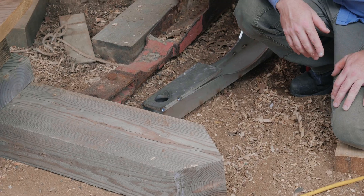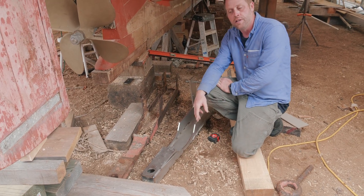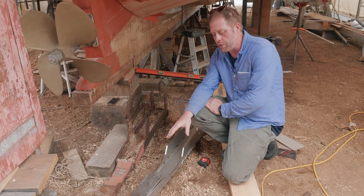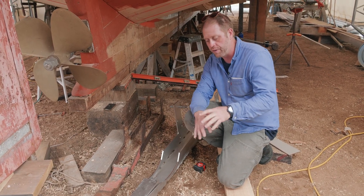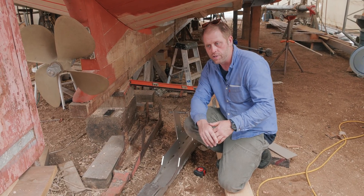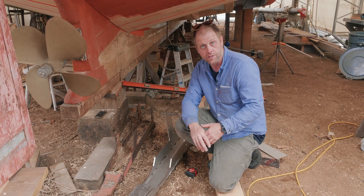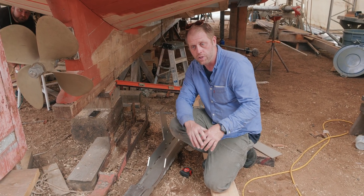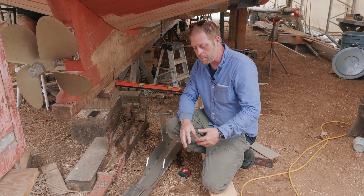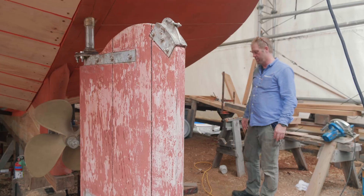If you look at the pieces here you can see there's a lot of metal with these little tiny welds on there, which are called tacks. Tack welding is a process in fabrication where you put little tiny welds in to basically fit everything up to the right shape before putting it together, and that has a couple of advantages. The main one is that it's easy to take apart if something is incorrect. It also locks your entire structure into form, making it less likely to change shape while you're doing the actual structural welding.